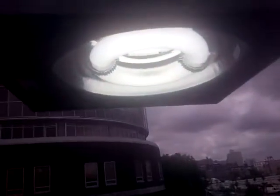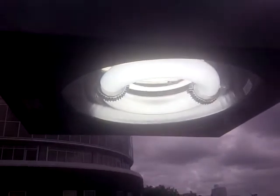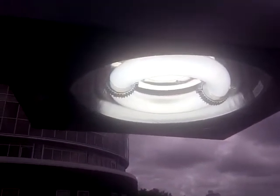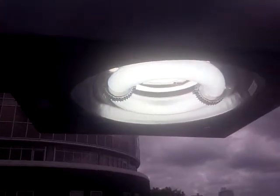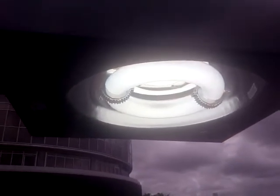And it's nominal voltage — this thing can go from 120 to 277 volts. These lights currently have a 277-volt hookup, but you just have three wires — a black, white, and a green — and the ballast will take whatever voltage you give to it, up to 277 volts.